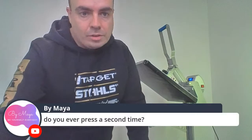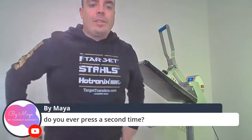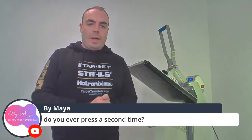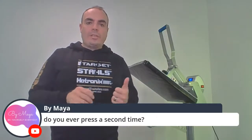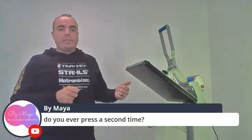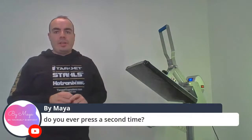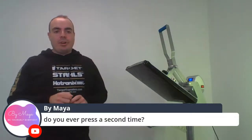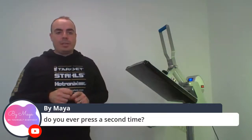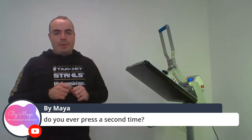So I just got a question here from Maya that I'm just going to quickly pop on the screen. So this is, do you ever press a second time? To be honest with you, it's rare that we press a second time. Because of the accuracy of the Hotronix machines, you've got perfect temperature, you've got perfect time, and you've got perfect pressure. So you can measure the three key factors in heat pressing, so time, temperature, pressure. If you can control and measure all of those, you shouldn't ever need to do a second press because you're going to get it right first time every time that way.